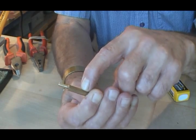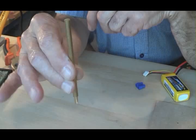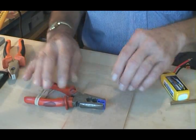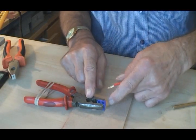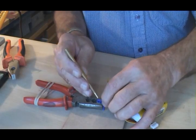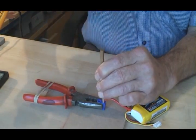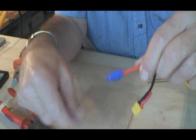I've worked out a better dodge. We've got a piece of quarter-inch brass rod, drilled 3.5mm down to a certain depth, then turned the end down to just under five millimeters and filed half of it away — so it's now like a punch that lets us press the soldered pin down into the blue housing. We know the flat pin is positive — the red one — and it's also got a plus sign on it. We prepare the pin, insert it into the correct hole, use our custom punch, and with the pliers providing pressure — there we have our plug with the red wire into the right side and it won't come out.